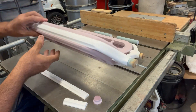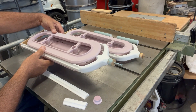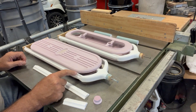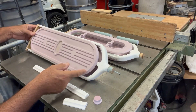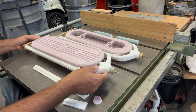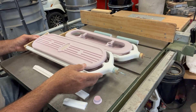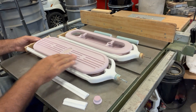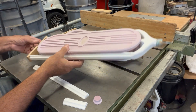You can see that the white polystyrene is the feed system and the pink stuff is the actual pattern. I use the white one for the contrast - it kind of helps in these videos. But also the white polystyrene is very low density, so it takes less energy to evaporate. In my mind, I think it means that the metal progresses farther down the feed system before it starts ingressing into the pattern. The next step in the process will be I dip them in a bucket of soapy water - just a little bit of Dawn dishwashing soap in water because the propylene glycol in the dishwashing detergent is a surfactant. That helps the refractory coating that I dip them in lay down nice and smooth on the surface without any air bubbles. And then I just go ahead and dip them in the refractory coating.